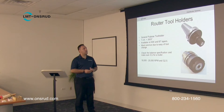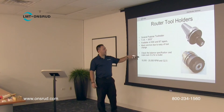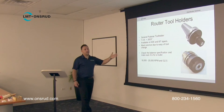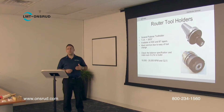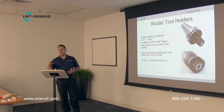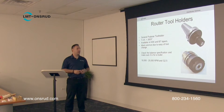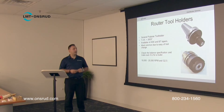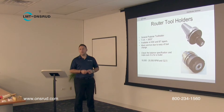The key thing to keep in mind when looking at tool holders is there are two different types: an A type and an F type. It has to do with the balance specification. Because CNC router machines typically spin at higher RPM — around 18,000 to 22,000 — they have to be specifically balanced to that RPM. Anything for a CNC router will have an F type designation, while anything for milling machines that spin at much lower RPM, maybe 6,000 to 10,000 RPM, will have an A behind the part number.